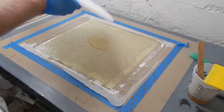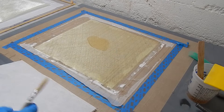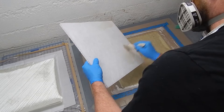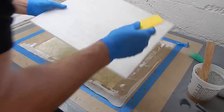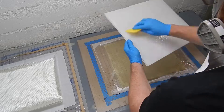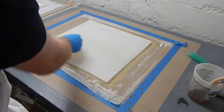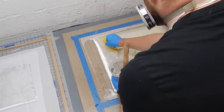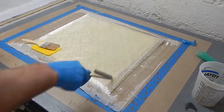Here's the honeycomb. You can see the big cells on the edge and the scrim bonded to the surface. I'm going to coat this with just a little bit of resin. I'm not really sure it's even necessary, but I pretty much always want to coat two surfaces that are being bonded together, just to make sure you've got resin on both sides. Here it probably would work without it, but I'm putting a pretty thin layer on there, flopping it down, and then adding resin on top. A bunch of this resin either came up from the bottom through the scrim or came down from the top. Unlike foam, it doesn't bleed through into the top skin — it just goes into the honeycomb cells and stays there.